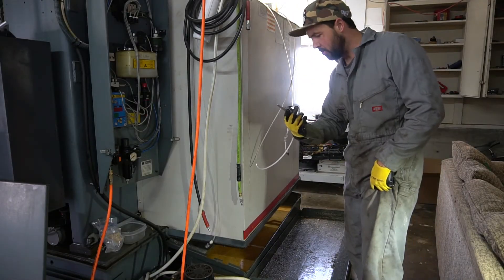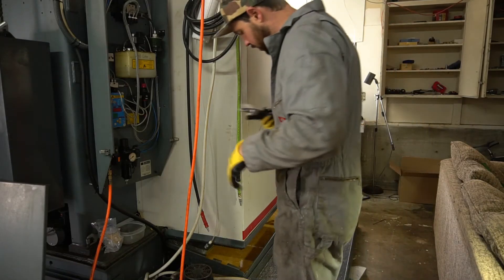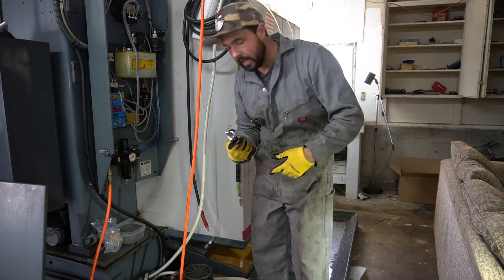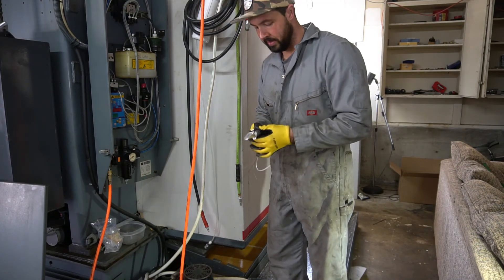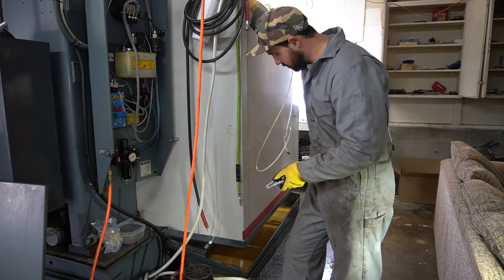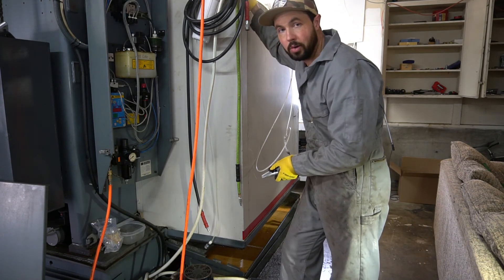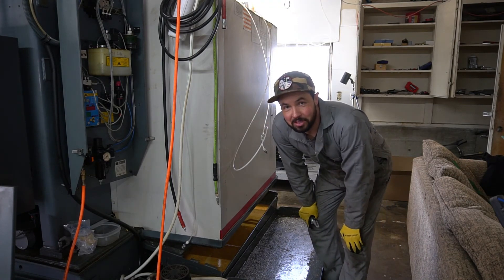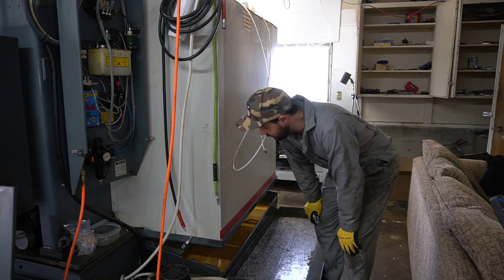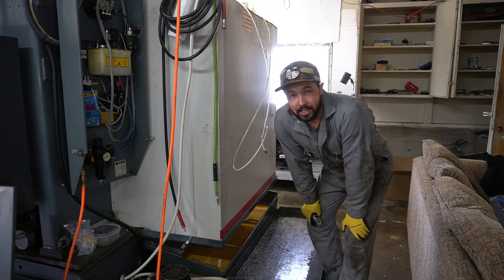Let's do another quick refractometer test and see what our levels look like. You can see the line pretty good there — just below 10. It's probably reading just a hair too concentrated because we don't have all the water in yet and we dumped it mostly on this side. But you can see how the level has changed through the refractometer. I think that'll get me through until my coolant guy can come take a look — probably at least get me through the winter. It's not super pretty, but it'll get the job done. The machine obviously hasn't been running for a while, so this coolant didn't get a whole ton of use. This was kind of a gross video, but it's part of the machining process, and coolant is a very essential component of machining. I hope you enjoyed it and learned something new. Keep your coolant tanks clean, keep your noses clean, get out and play some golf, and I'll see you next time. Take care.